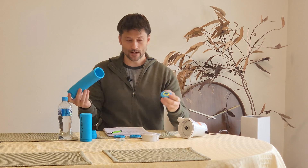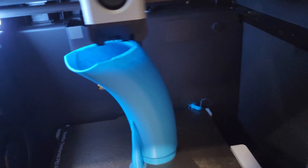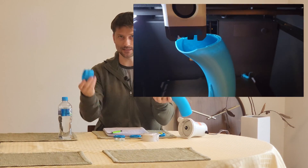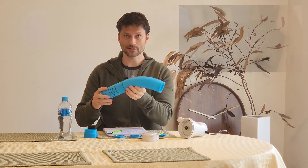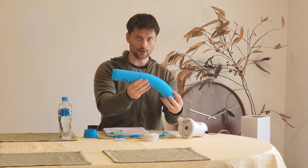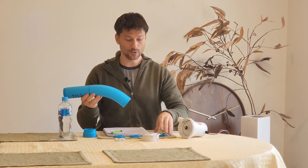Playing with the 3D printer, I made a 45-degree curved tube. These tubes here are really interesting — this is a metric 58-millimeter thread by 2-millimeter, and this is an adapter which goes to my flow meter on one side and to my thread on the other. 52 millimeters inside is essentially a 2-inch tube, so this would represent your 2-inch dredge. I built this so that I could suck water out of my tub, run it through the flow meter, and when I start playing with Venturi designs, use this.